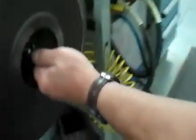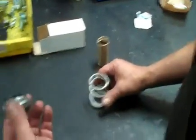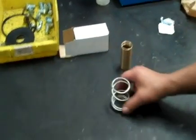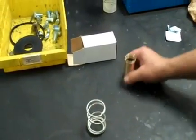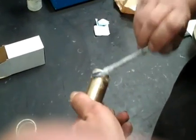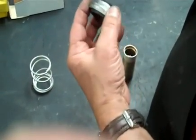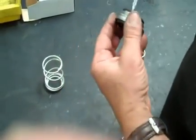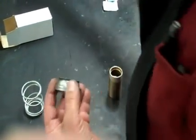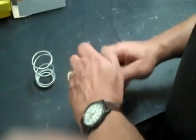Once you get that good, you want to fit that keyway — face it straight up so it's easier to align everything. When you come back over here to the seat, you pop the little seat face off. Leave the spring in the flat part. Get a little more lube. I like to put just a little bit on the lip here and then some on the outside of the sleeve. Then you clip it on the rubber.